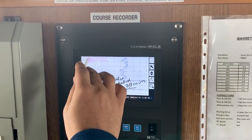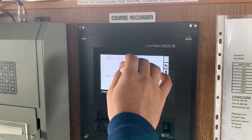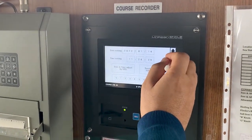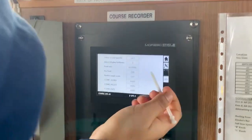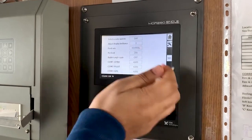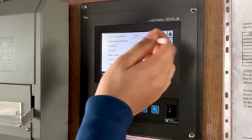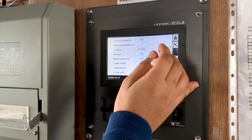When you go to the home page you will see a correct timestamp. So you can put a mark and sign if you like. When you press tools a third time, you will see the settings for gyro, for GPS, and feed rate — normal or fast. Feed rate normal means more data will be saved. You can put it to fast if you want and then save, but I will keep it in normal only.